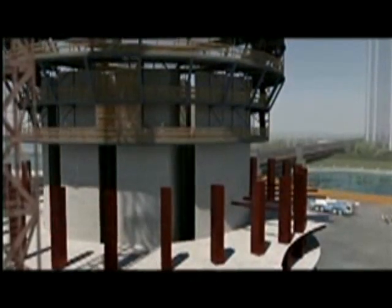The structural frame is radial steel beams, steel columns, and a metal deck, and a perimeter system to pick up the changing geometry. There's a lot of complexity in foundations and in the base of any high-rise building. So the sooner we can get to a standard level of framing and move up from there, the faster the cycle can be achieved. In a high-rise building, construction cycle is extremely important.